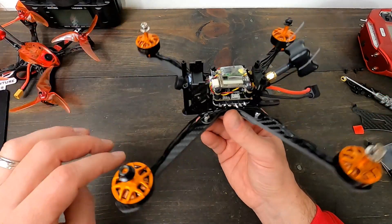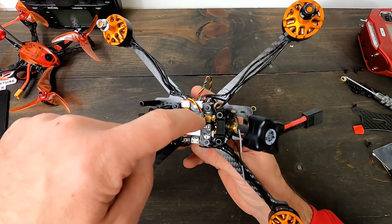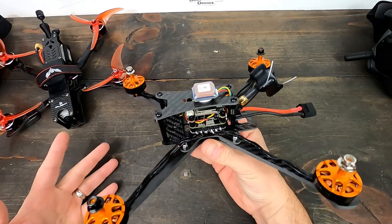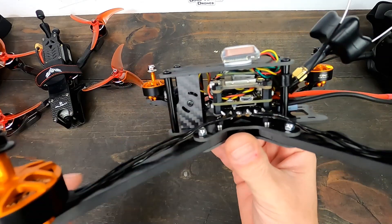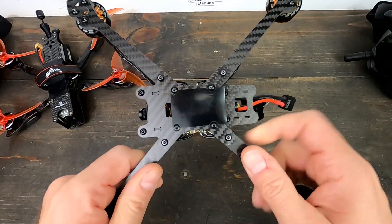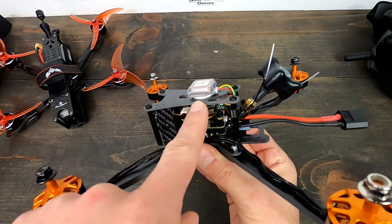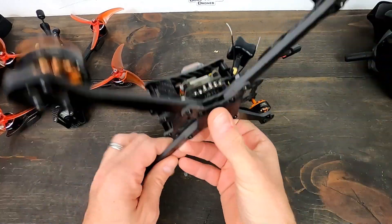Put the standoffs in, twist them in, add the receiver on top. I ran the wires out the back of the 3D mount and added a TBS-style antenna on the back. Then put the camera in place — I put in one screw to start and add two more after I get it positioned how I want. Bind it to your radio, then the top plate goes on and GPS goes on top — notice the standoffs there for the camera. I'm mounting the battery on the bottom since the GPS is on top; I added a little piece of rubber to keep it in place. Make sure you get all the screws and motor screws tightened.